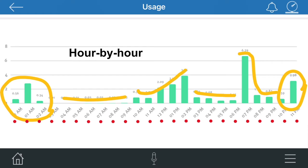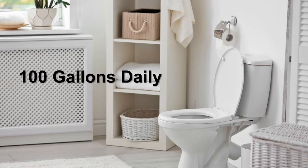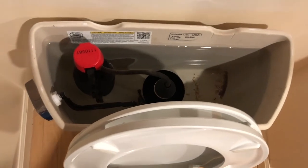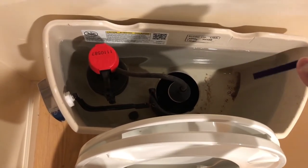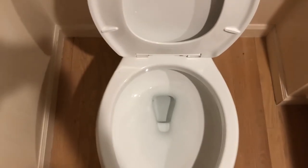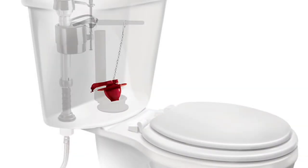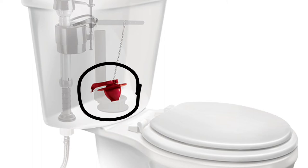Sometimes graphs like this can have significant irregularities, and in those cases there's very likely some kind of a leak. Let's take a look at one of the most common ones: the toilet. If you have a leaky toilet, you could be wasting upwards of 100 gallons daily — that's the equivalent of flushing your toilet 25 times. Fortunately, toilet leaks are easy enough to detect. You can request a toilet leak detection kit from the Cascade Water Alliance or your water district, or you could simply put a drop of food coloring into the tank. If the color shows up in the bowl within 10 minutes, then you have a leak. My toilet here didn't have one — you can see the dye remains in the tank but not in the bowl. In toilets, the most common source of a leak is the flapper. It's made of rubber, and every time you flush, the chain is lifted upwards. This wears out the rubber flapper occasionally, but replacing the flapper is pretty easy and should take care of most leaks.